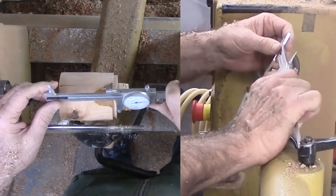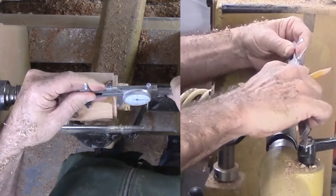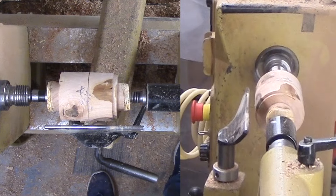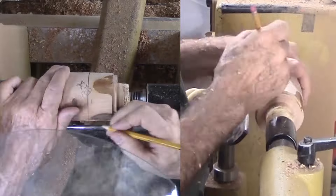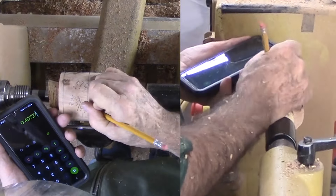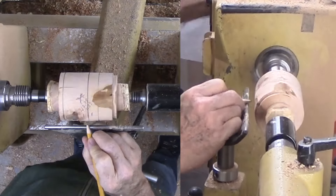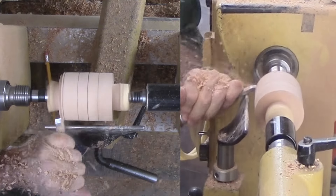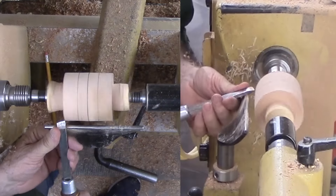But wait, there is a little bit of paperwork to do — well, not paperwork, just a couple of extremely useful calculations needed to use the octagon method. After measuring the diameter, I decide to work outward from the middle. The only difference here is that I cut the calculated measures in half to work from the middle out. I'll repeat the key factors in the description — there are still only two factors to keep in your phone notes. That old tenon gets cut off as I cut both ends down to equal the diameter of the octagon side. Since I will be cutting off the corners anyway, I cut a new tenon.